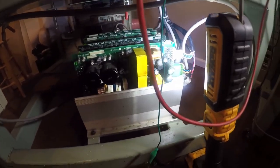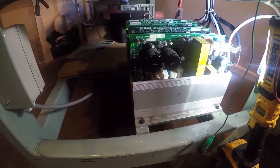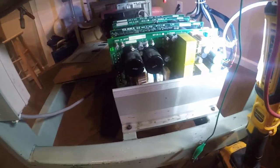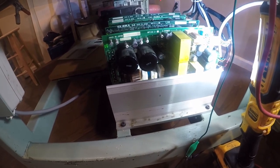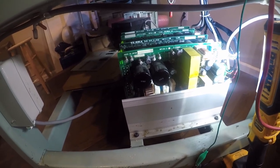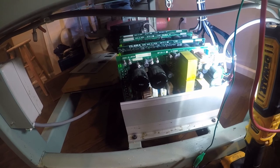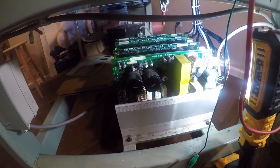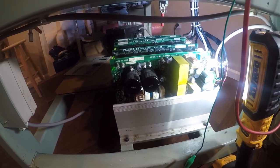More than likely it's something reasonably simple. I've got three fuses there, a fuse there, and a fuse there, and I just got to figure out what the different fuses do on this card and see if I've got a blown fuse. Absent a blown fuse, I've got to figure out what component has died on here, and then we'll go from there. It may wind up being something where I patch in a 12-volt power source, because I'm not spending eighteen hundred dollars for this card — not happening. Not spending nine hundred dollars for somebody to replace a couple of components either. If I find the components, I'll replace them, but until then that's where we're at. Thanks for watching.